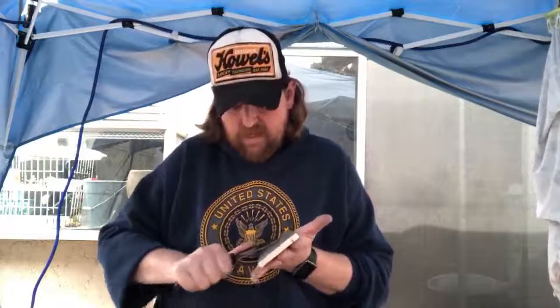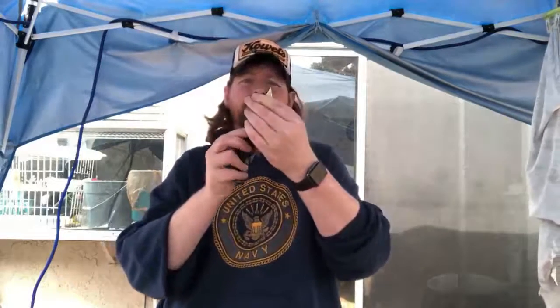So this, I'm not gonna lie to you, Sean, this edge is not gonna be as thin or feel as slicey as it did before, and that's 100% because the edge is not gonna be as thin. This is a very thick blade. It's gonna be sharp, but it's gonna be a much thicker edge, and it's just the way it's gonna have to be. I can get a little bit thinner because I'm using a convex, which should have more material to support that edge. It'll be sharp, but I'm not gonna lie, that thing was slicey as hell, but that's because it was too thin. And had you cut anything substantial with it, you would have found out real quick that that edge wouldn't hold.